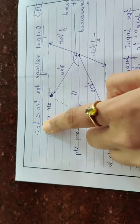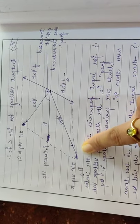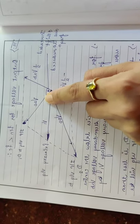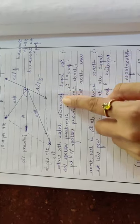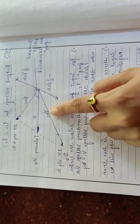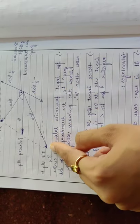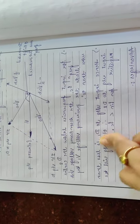The third case is where Fin is less than Fc. In this phasor diagram, the input voltage to diode D2 is more increased with respect to the input voltage to D1. For input frequencies below the center frequency Fc, the secondary voltage — half of Vab — leads the primary voltage by more than 90 degrees. Hence the output voltage of D1 is less than the output voltage of D2, and the output becomes more negative.